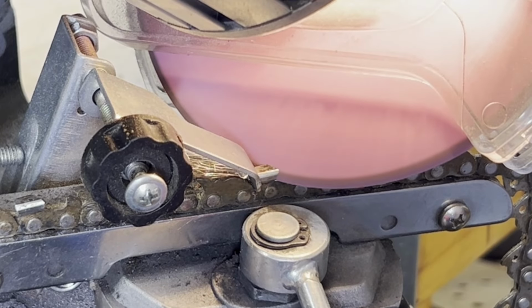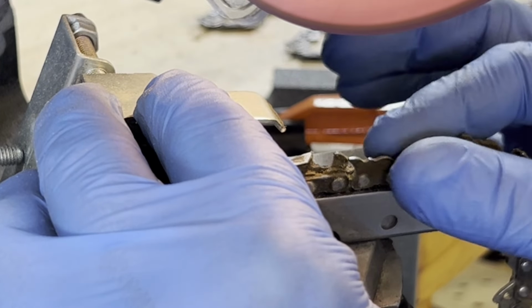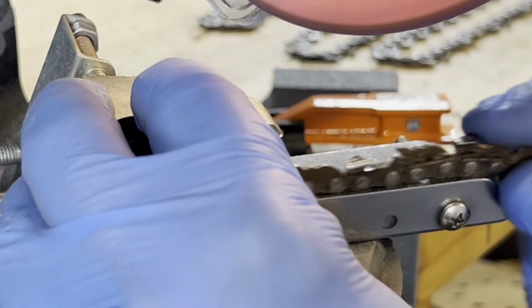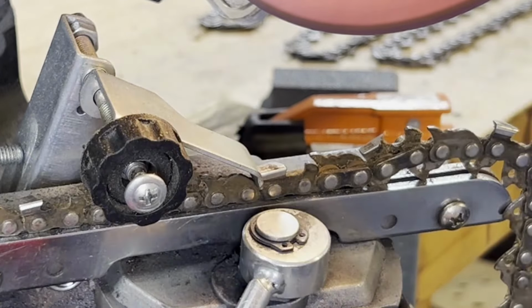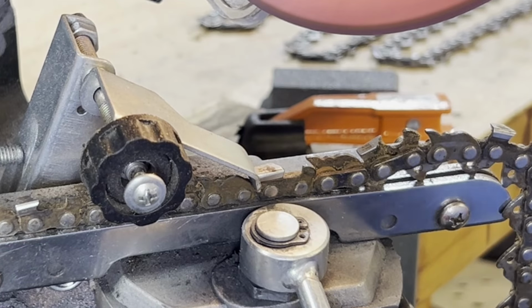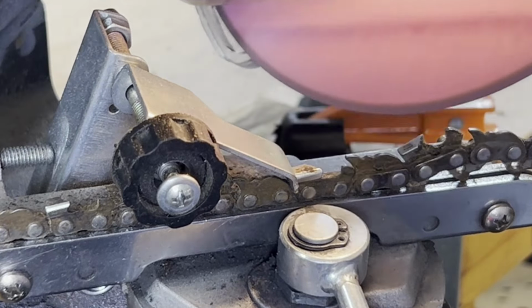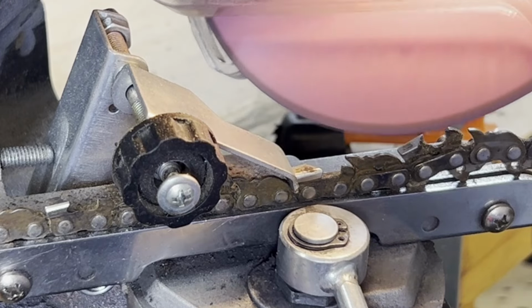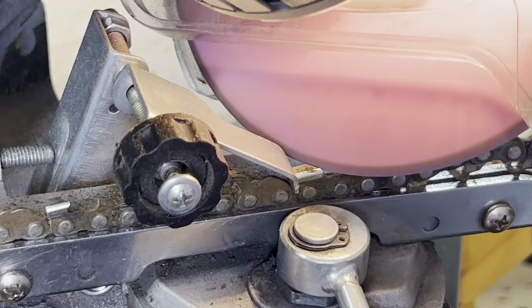And then you would think this is overheating it, but it's really not. If you put your finger on there, it's warm, it's a little bit hot. It varies some, but it's really not that hot, and it has to be very hot to take the temper out. So again, this is taking way more than I originally thought it would now, because I had a short tooth. But anyways, first cut,